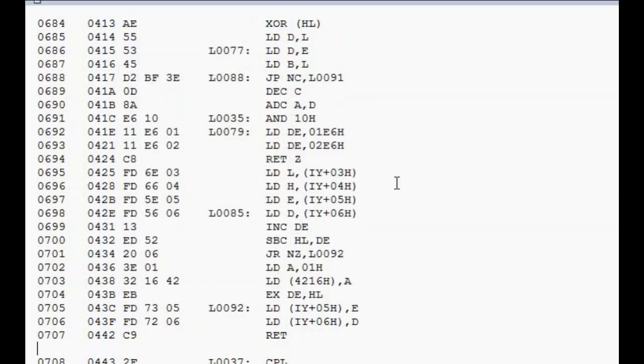And then I went through the entire file and did that, and you end up with blocks of code that may or may not be functions. But chances are some of them are. The next thing I did was to use a combination of the scope and the logic analyzer to hook up to various devices. So for example, I'd already identified the scratch pad memory. What I could then do is trigger on particular writes to that memory, and that in turn would allow me to figure out the memory mapping for each of the devices.